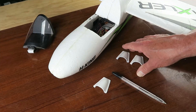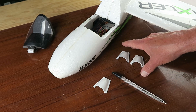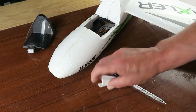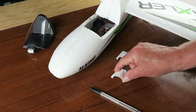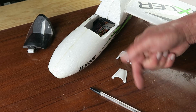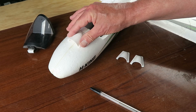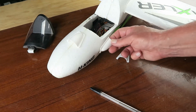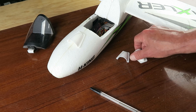The rule of thumb with this type of airflow is that you have to have twice the area for the air to exit as it does to enter. The simple answer is just to use my 3D printer to print three of these little air scoops — a design from Thingiverse, links in the description. My idea is to put one on the top here to scoop the air in, then place two underneath the wing for the air to exit. That's the plan.